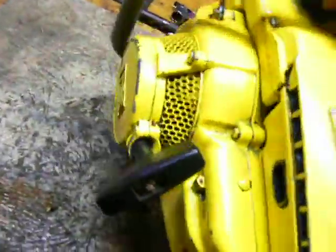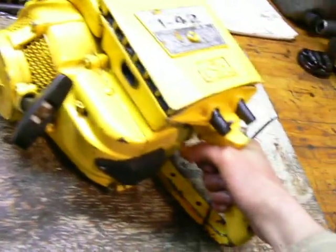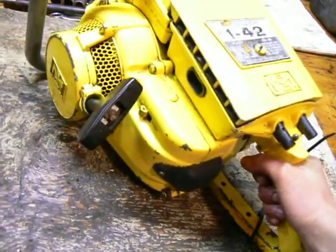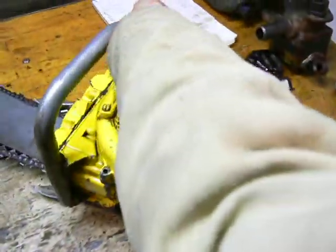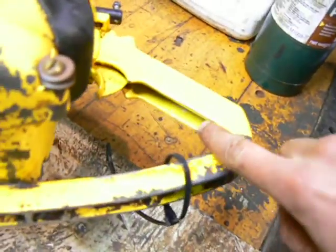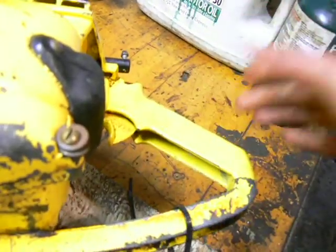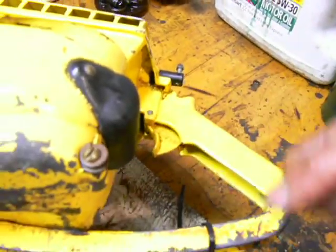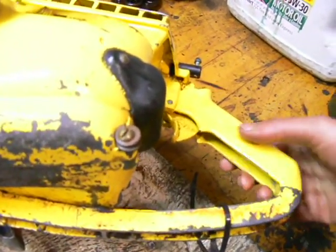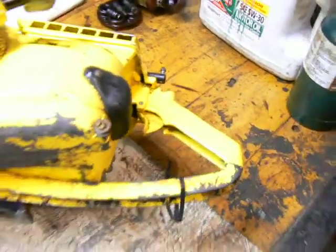One of the features I don't particularly like is that there's no throttle lock. You have to hold the throttle with one hand while you crank it over with the other. In addition to being a little dangerous, it's just sort of a pain. Also, something I never really noticed — the underside of the handle is just hollow, so it's kind of uncomfortable to grab, especially since you're usually pulling up on this handle to lever the saw through a log. I'll probably just stuff something in there and wrap it with tape so it's a little more comfortable to use.